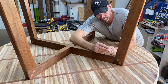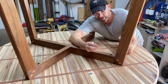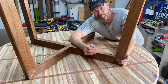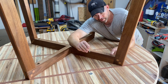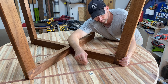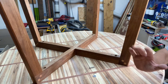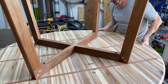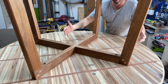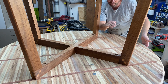Being a bit overzealous with the glue here but I don't want to miss any points of bond. There are a couple of dodgy bits where the router shifted a bit jumping through different densities — you really do have to take your time. I'm only putting these screws in purely to pull this piece of timber down, and then I'll take them out later to clean it off. So the screws aren't actually needed structurally — it's basically the clamping mechanism. The screws have pulled it down that little bit more, giving better glue squeeze-out and hopefully a better bond.